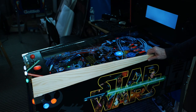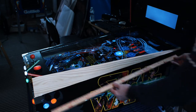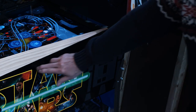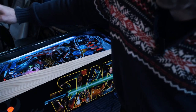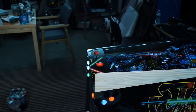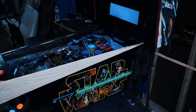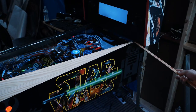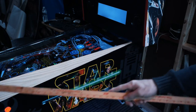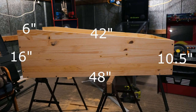You can see what it would look like if I hadn't done that — it would just be kind of like a coffin. This cut is a little bit more than a yard long. Up here is 6 inches flat, and then after about 6 inches I start taking that angle down at about 10 degrees, ending up shaving off about 5 inches exactly. So if you mark your wood 5 inches down and 5½ to 6 inches out from the top, you leave that normal and begin your cut at 5½ to 6 inches, then make your way down to 5 inches. That will give you a nice little angle. I wish I had the original video of that, but I lost it. Here are the actual measurements of my final cab, if that's any use to you.